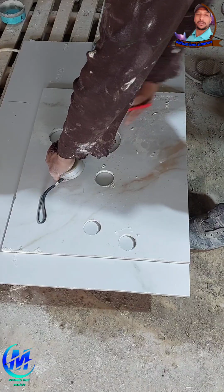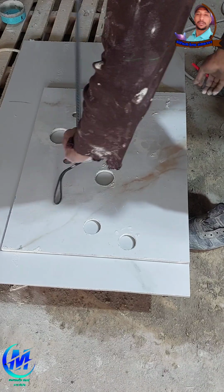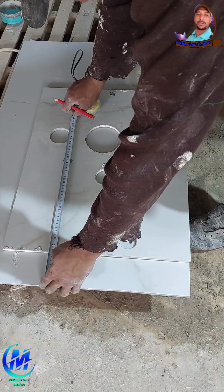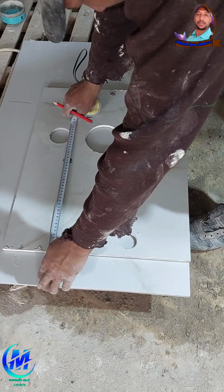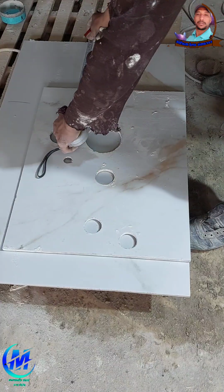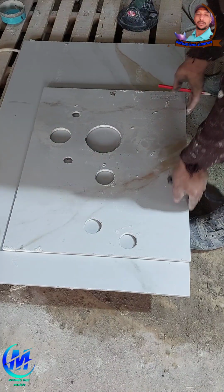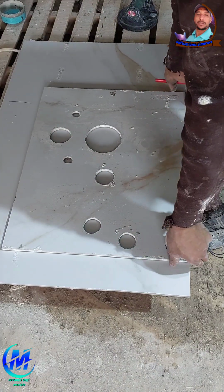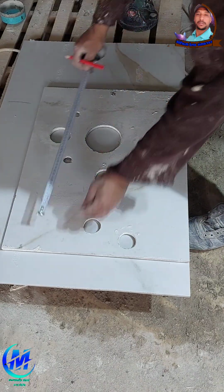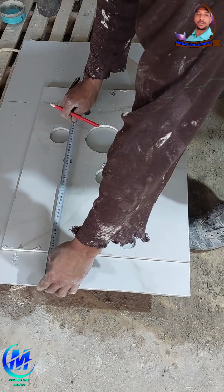9. Let it set. Patience pays off. After completing the first row, let the adhesive dry for at least 24 hours before adding more tiles. Avoid walking over the area. The goal is to ensure a solid, undisturbed base. Rushing into the second row can shift your entire alignment and ruin the work. 10. From one tile to a masterpiece. You nailed the first tile and first row.